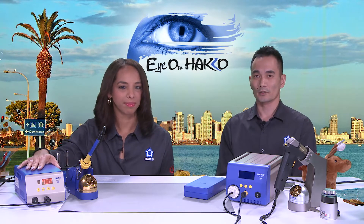Regarding soldering stations, there are other heavy-duty soldering stations available from competitors as well — Metcal has a dual-heater-type heavy-duty iron, Weller has a 200-watt iron, and JBC has a 250-watt station. But at 300 watts, the FX-801 is the most powerful soldering station out there.